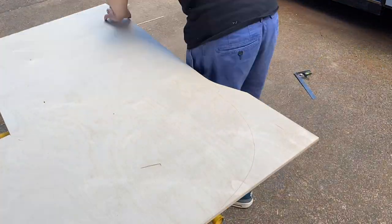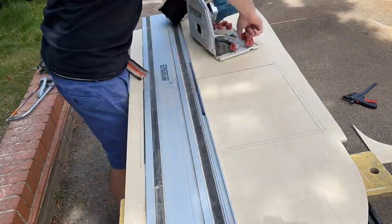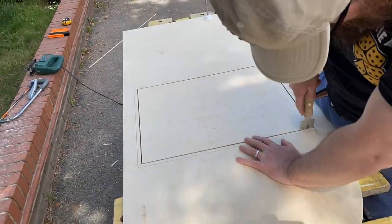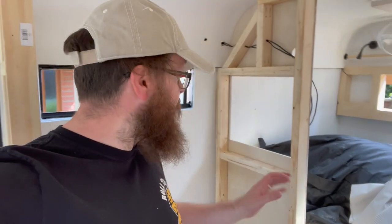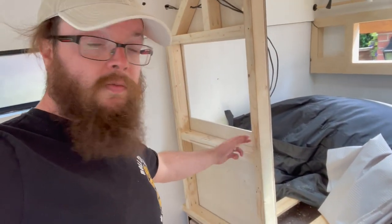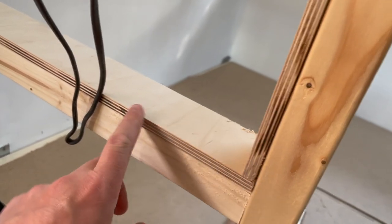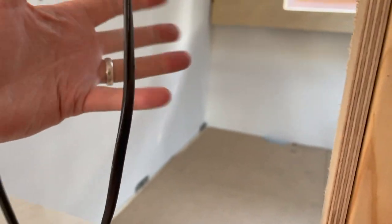To achieve this, I first cut the end piece and used this piece of batten upright, drew around the edge, and then cut it out with my plunge saw so I could make sure it was nice and straight. This gave us the opening for the inner bedroom storage. We're marking it all up and having to take it in and out because with this end piece in, the next thing I need to do is cut strips that will sit in here. These are similar to the ones at the back — I've just cut them so they run parallel with the pattern and it will frame in the storage accessible from the bedroom side.